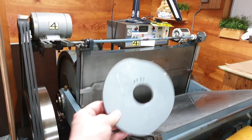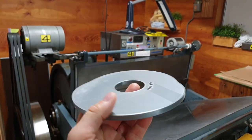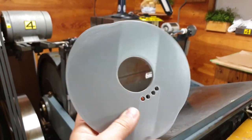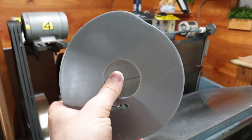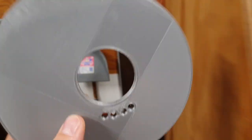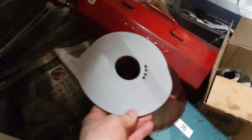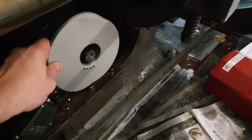Alright, we're back and I've got the part — that grey PET. Looking pretty good. I might have to do a little bit of adjustment on these holes, depending on their clearance with the bolts and stuff, and maybe this one here. That's sized to the exact size of the old part, but you know, tolerance and stuff. I might have to give that a bit of a file. But that is going to go down in here in place of this one. It should be a perfect replica to sit there.